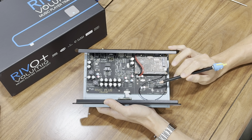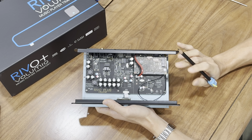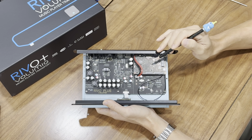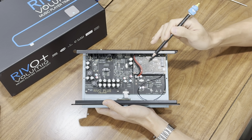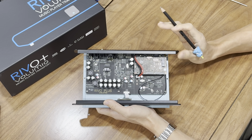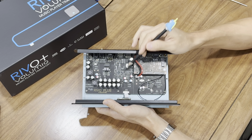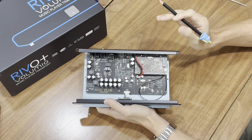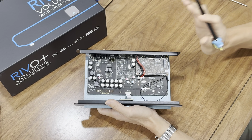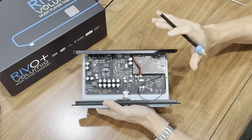Handling the system control is a dedicated microcontroller. This is not what you usually see — most other manufacturers use the same ARM processor to do everything. But Volumio decided to have a separate control unit for the rest of the operation. This keeps things running smoothly without interfering with the audio signal chain, giving you seamless integration while keeping the audio chain and the processing separated.